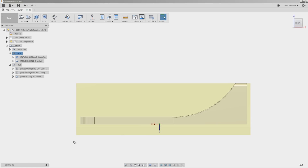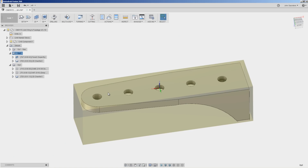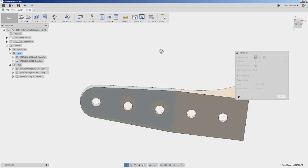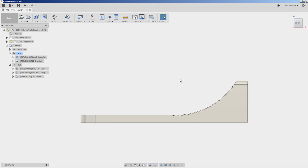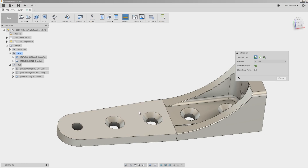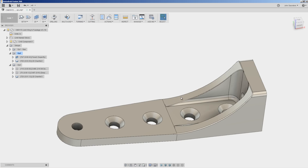Adding more material on the underside can help even out stresses as you machine from both sides. We could try using a smaller diameter tool instead of the Superfly when decking off, which may change how stresses are relieved. You could also leave extra material on one side, skim cut the backside, and come back to finish the top — tackling it more evenly from both sides. You could back-bend the part, though I don't like that, especially for an airplane part. Or you could redesign — making the bottom face thicker by 50 or 100 thou, or extending the ribs out for additional strength. We had fun making this part; the takeaways are the workholding techniques, how to walk through operations, and tips and tricks on the Fusion 360 CAM side. Hope you learned, hope you enjoyed — see you next Wednesday.